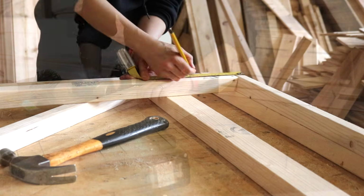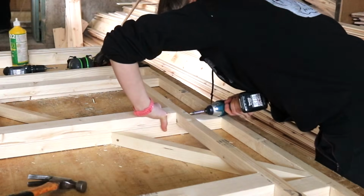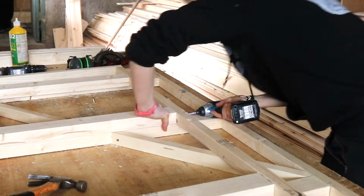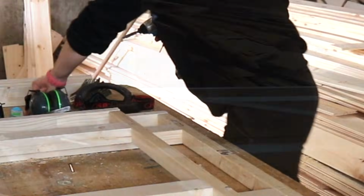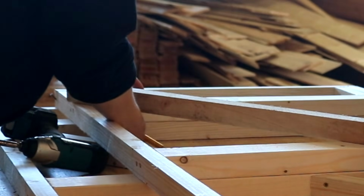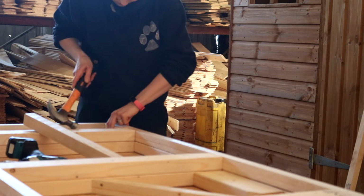I then use that stacking method again to make my next 2. With these ones being much narrower, or if you're installing a really lightweight gate or door, some say you don't really need a brace, but to be on the safe side, I added a small one on the bottom of each door and 2 smaller wedges above and below the 2 spars on the bolt side.